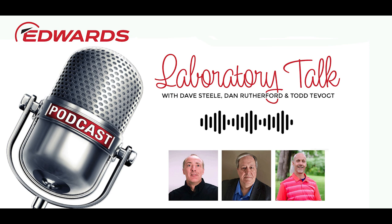Edwards has been making scroll pumps for quite some time. Do you want to give us a little bit of the background history of how we started down our journey of scroll pumps? Early scroll pumps were based on the scroll pumps used in compressors, air conditioners, things like that, and they'd been adapted for use in the vacuum market. But we saw that there were ways we could improve on that and did a lot of development work in the late 1990s. What we were after was an arrangement whereby the scrolls were single-sided — you could take one scroll off and expose the other so you could change the tip seals. And we were also looking for the bearings to be protected or separated from the gases being pumped.